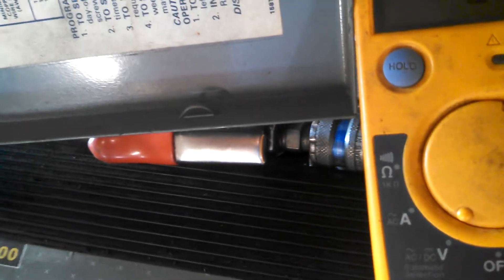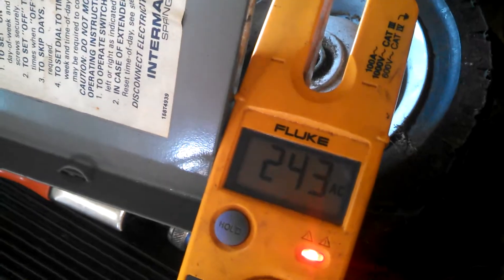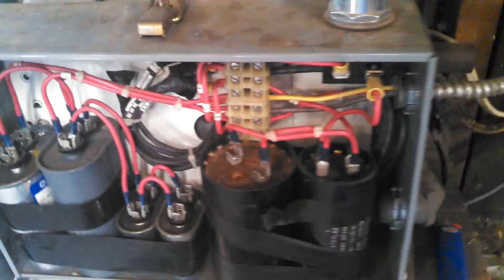Let me show you with a tester. This should be my leg reading — 244 volts. Drop down here — 242, which is pretty close. Drop down here — 243. So it comes out pretty good. Even on my welder I'm only getting 243 from the power company, so it's hard to get the voltage exactly where you want it, but if you get within a couple volts, you're pretty good.